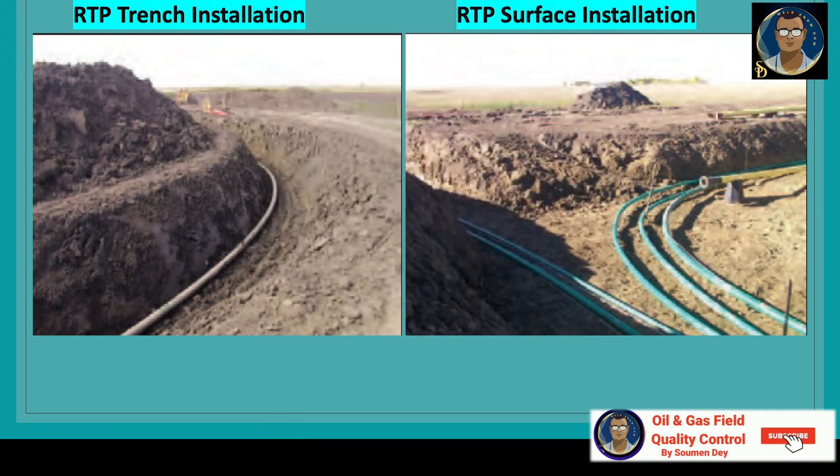For narrow trenches slightly wider than the pipe, the RTP can be deployed alongside and lowered into the trench manually after any necessary connections have been made, or the trench can be widened at the areas where connections will be made. It is good practice to allow some spacing between multiple lines laid in the same trench; however, if construction conditions do not allow for spacing, it is acceptable to lay the lines in contact with each other. This applies only to lines running parallel in the same trench. If two RTP line pipes are crossing over each other, one foot of spacing is required between the two lines, unless a more strict regulatory requirement applies.